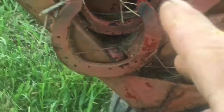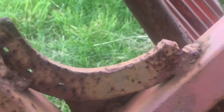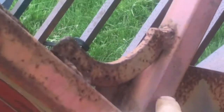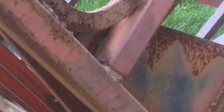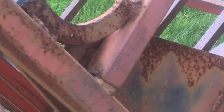A lot of times when I do welding on these, I'll use scrap horseshoes — they just have a great radius to reinforce between angles and tack them on there. There are a lot of areas on here where this type of steel starts bouncing around and vibrating going down the road, and you'll end up with a lot of breakage — you constantly have to be tuning stuff up.